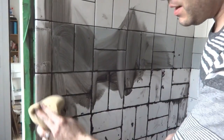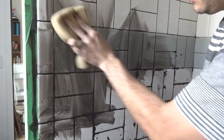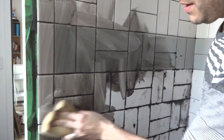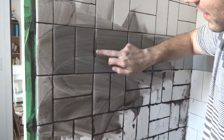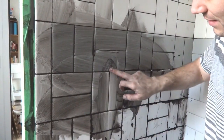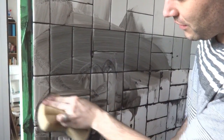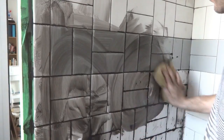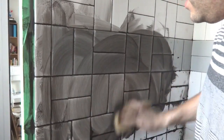Because of the way we did our tiles — these subway tiles stacked against each other — there's only about a 16th of an inch gap, so the grout lines are actually pretty small. But you can see how they're thinning out nicely. This line right here looks a little thick, this one's okay, that one's too thick — just wipe it a little more and look at that, thinned down real nice. Go over all of them and make them even. Once they look good, stop — the more you wipe the more you take off.